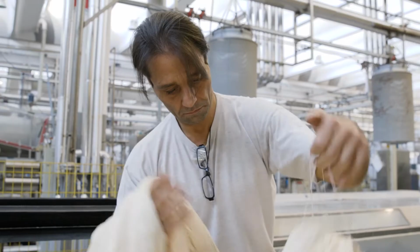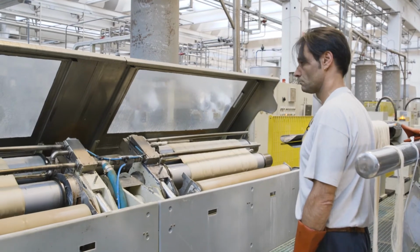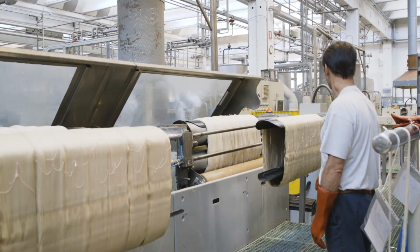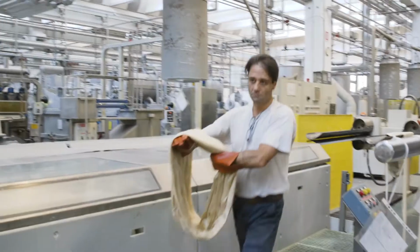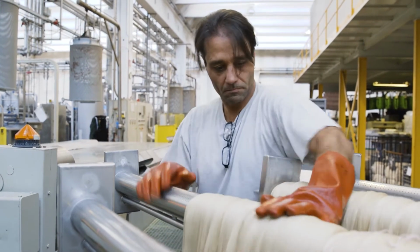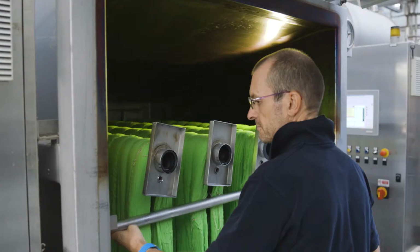At the dye house, the first step is mercerization. This process swells the fiber so that it absorbs more vibrant color, in addition to making the thread stronger and more lustrous. During mercerization, the hanks are looped between 2 metal rollers, pulled tightly, and put through a special wash. The tension created by pulling the thread makes the staples parallel, so they are straight and strong. After mercerizing, the hanks are washed and put into a dye machine for 8 hours.